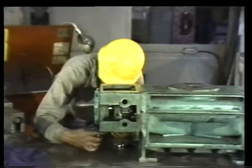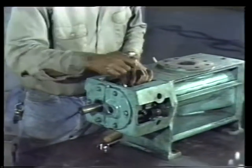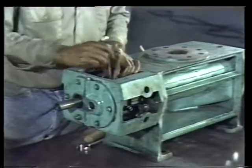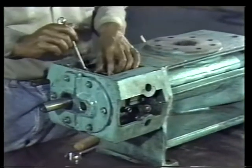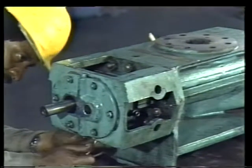After the last bracket nut is tightened, make your final adjustment to the seal plate. This adjustment is important. It ensures that the metal sealing surfaces and the carbon sealing surfaces are correctly aligned to form the best possible seal.